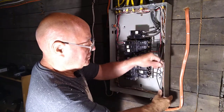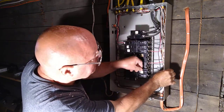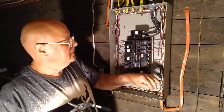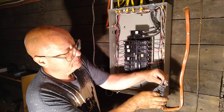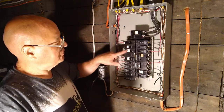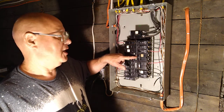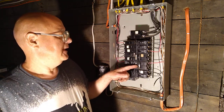We'll do the same with our black wire — I'll bend it down to the corner of the box. With 220/240 we're using a double pole breaker — that's how you get your 240 volts. If you put a single pole breaker you're getting 120. So for your standard outlets here we use single pole breakers at 120 volt; for your water heater, stove, or dryer we use a double pole breaker — 30 amps for your dryer and 50 amps for the stove.